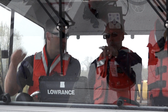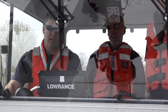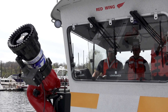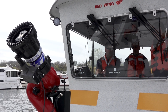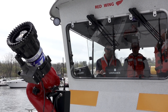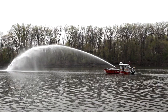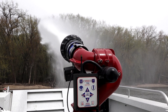Now tell us a bit about the — I'm going to call it the nozzle. That's actually called a monitor. This boat is equipped with two outboards — they're 225 horsepower apiece — and it has a separate motor for the pump. It's a 6-liter marinized Chevy motor that's 385 horsepower just to run the pump. It's got a 1,500-gallon-a-minute pump, so we can put 1,500 gallons a minute out of that nozzle.